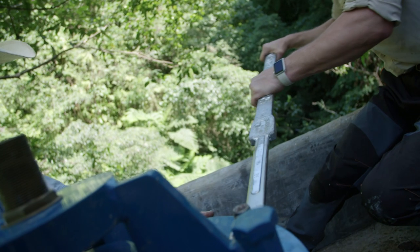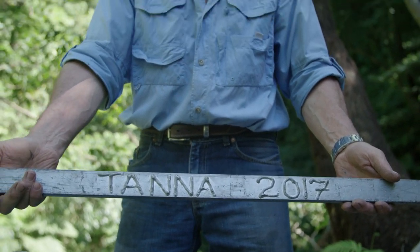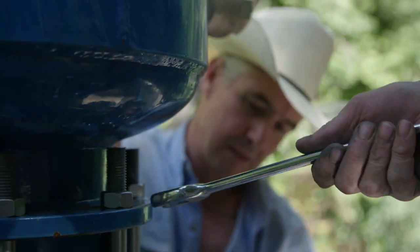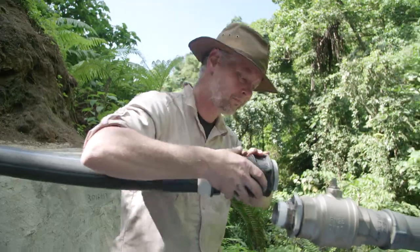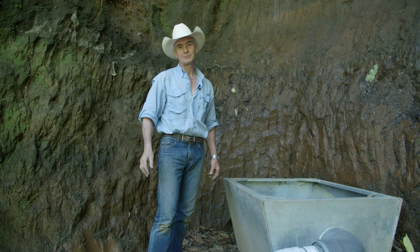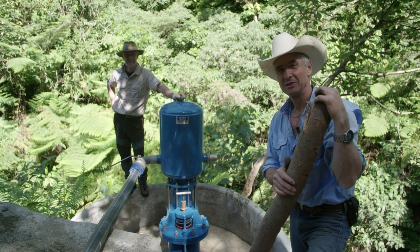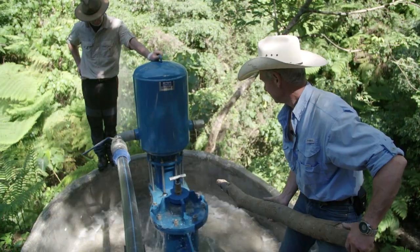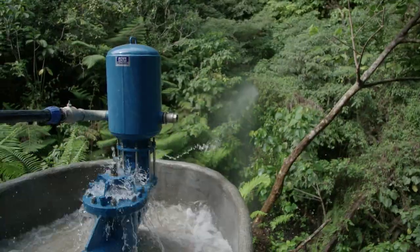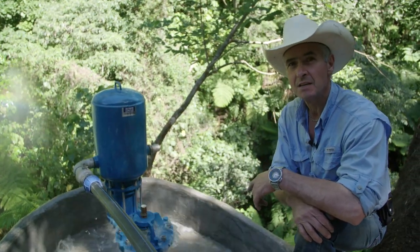Here we are bolting up the waste valve to this ram pump base. First stage in commissioning our Rampo 600 here in Lapa Nguyen, Tana, Vanuatu. Now we're going to turn on the water to the surge tank — this is coming from the top of the waterfall, which is about 15 metres above us, through to the back of the surge tank here. This is the moment of truth — the first time we're going to commission this pump. Success! This pump will be pumping 135,000 litres a day. This is really rewarding.